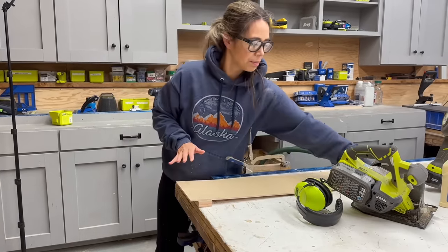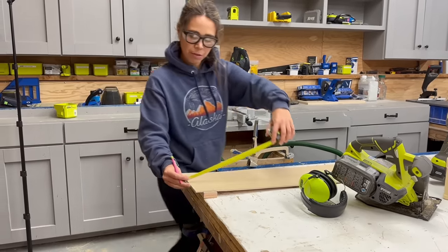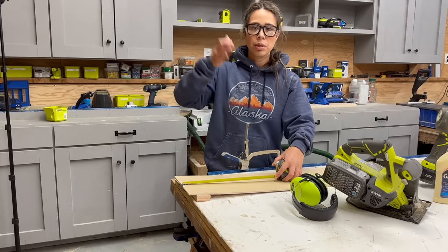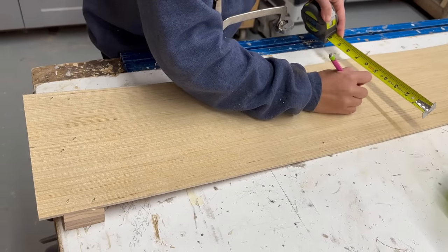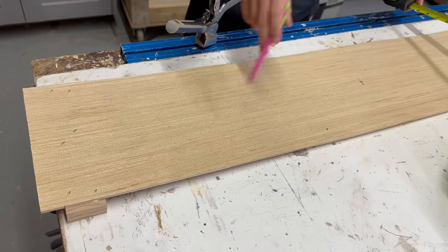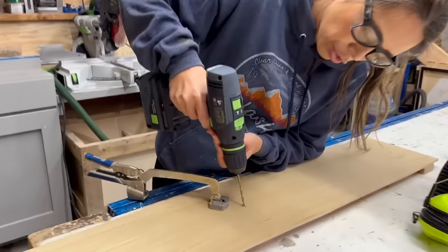So what I'm going to do is flip it over and then I measure and mark that center point, and I measure down from it whatever radius I want. The tabletop that I'm working on right now is a 44-inch diameter, so I'm going to split that in half to a 22-inch radius. I'm just finding the center point this way, and then this mark is the radius of the tabletop. You can make additional marks — if you want a bigger table you'd go this way, a smaller table you'd go this way. And I'm just going to drill a hole, and this hole actually matches the shaft on the screw that I'm going to use later.